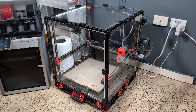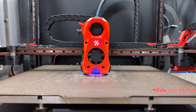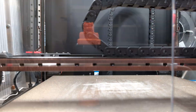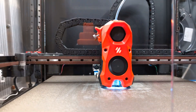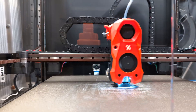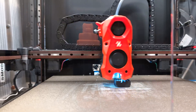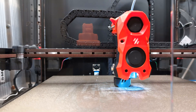Let's take the printer for a spin finally. TAP is now what is used to measure the distance from the nozzle to the bed, and as you can see, it works perfectly. Here you can see the new nozzle cleaning mechanism using the X1 Carbon mechanism. And now a complete print of the Voron test cube. I'm very happy with fixing many of the issues from the initial build. The camera in the back is super wide-angle and upright this time. I fixed the belt tension issue. The filament in the back is now much lower and has a better position that introduces less bend in the Bowden tube. The new tool head is just awesome — with TAP, better part cooling, and the LEDs are a nice touch as well.